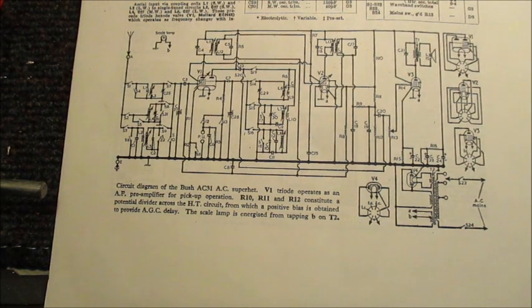In passing, I'll mention that the ripple waveform may be treated by ordinary AC theory if it is considered as a fundamental frequency with a series of harmonics. The design engineers at Bush Radio and Television Limited would have known the exact proportions of the PI filter, very likely having applied Fourier analysis, named after French mathematician and physicist Jean-Baptiste Joseph Fourier. If you'd like to know what Fourier analysis is about, I've included a YouTube video linked below, which I suggest is an excellent introduction.